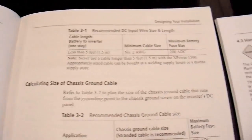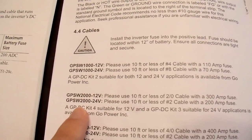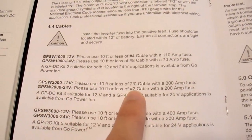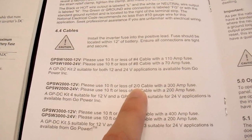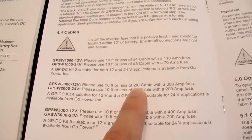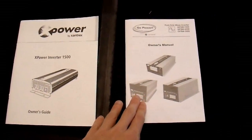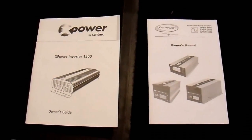Different manuals disagree. Over here I have a different company's inverter. We can see the 2000 watt model from this company, and 2000 watts isn't all that much more than 1500. You can see that they say 10 feet or less of two-aught cable. Now, two-aught cable is extremely expensive — it's very heavy and it probably costs you at least five bucks a foot, so that ends up being a lot of money. Why does this one need so much heavier cable? In general, the manuals are good guidelines and you can just follow those guidelines, but I never do when I size cabling. I'm going to go over how I size cabling for inverters.